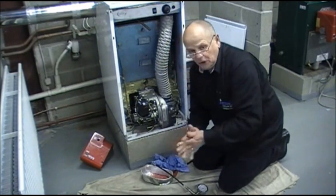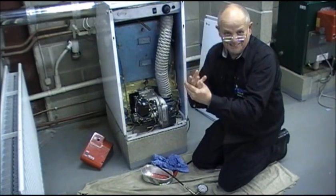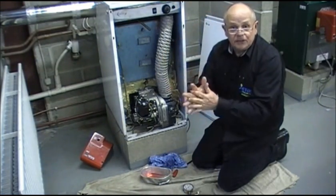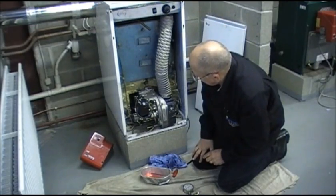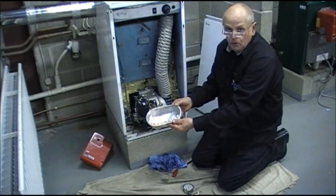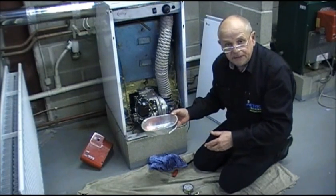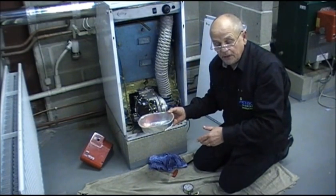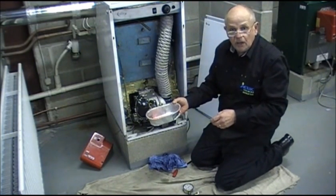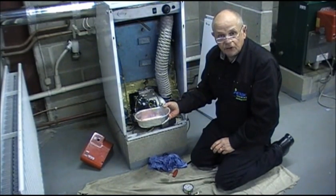Do not leave oil standing because it's flammable and dangerous. Also — and I forgot to mention — we really should be using gloves to stop any contamination of your skin. We will end up with some residual oil. If it is clean oil, put it back in the tank. Do not throw it or pour it down the drain or on the ground — it is a pollutant. If it is dirty, take it to your local authority recycling centre or a licensed waste disposal facility. Generally, if there is a little bit, your local council will have a recycling tanker.